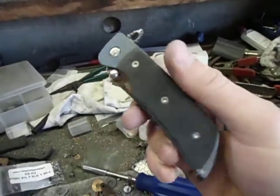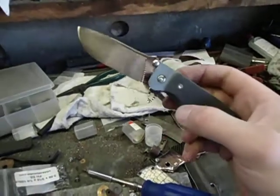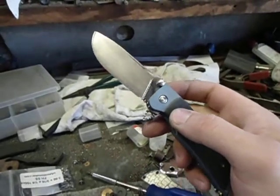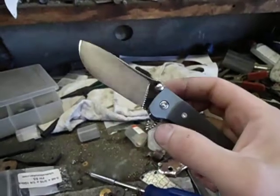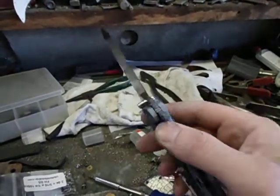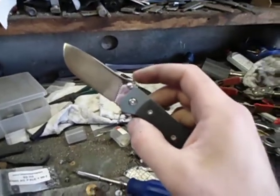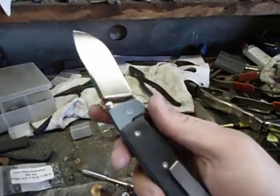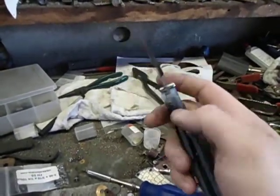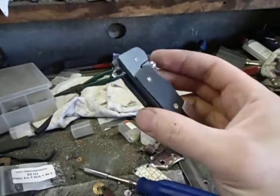I hope my client likes it, because I actually made three of these blades — this will be the third one. I was experimenting with a different heat treat in my new heat treating oven, and I found out the hard way that you really have to wrap M390 in foil. Otherwise it will oxidize so badly that it loses a lot of dimension. Didn't know that. Previously I had been heat treating in open flame. Some people would say, 'What? You can do that?' Yes, you can. I actually like it, because the flame burns all the oxygen out of the forge, so the steel doesn't oxidize. But yeah — foil wrap. Very nice.